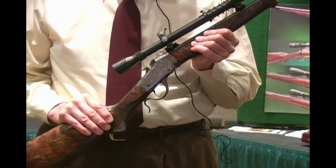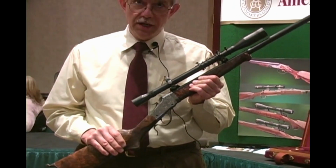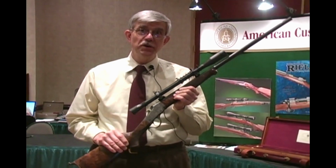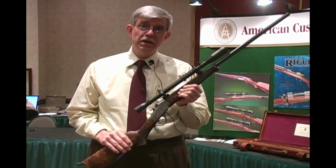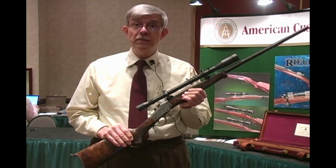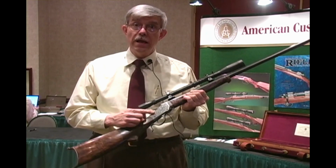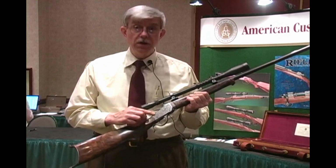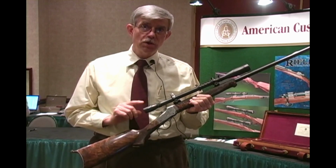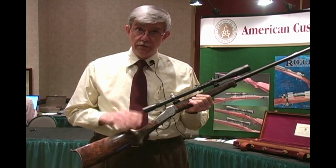And I had the unenviable task of taking Jerome's nice pristine engraving and heating it up to about 1350 degrees and then throwing it into a tank of cold water. The colors came out well, but we decided to remove the colors from the action and gray it so that the colors would not hide Jerome's good engraving. But the colors were selectively removed in other areas that weren't engraved.